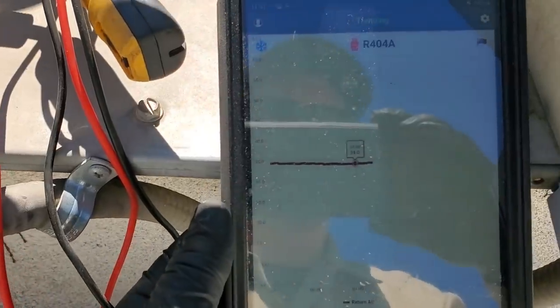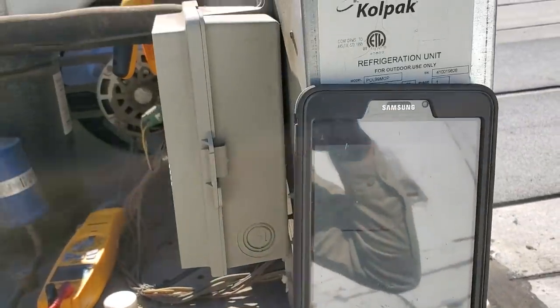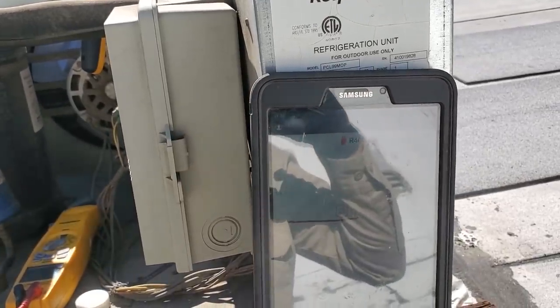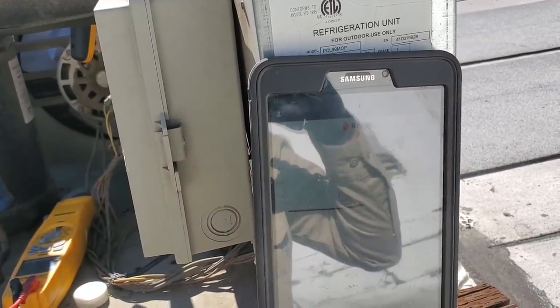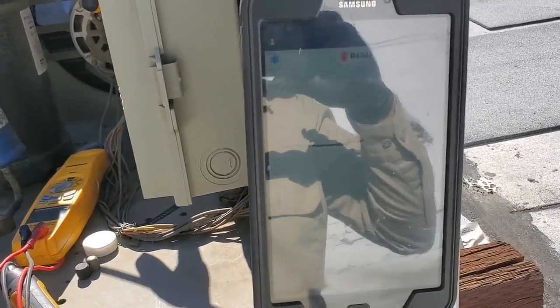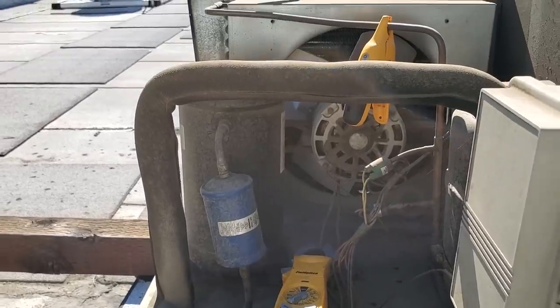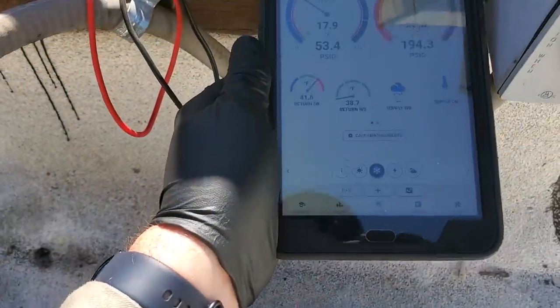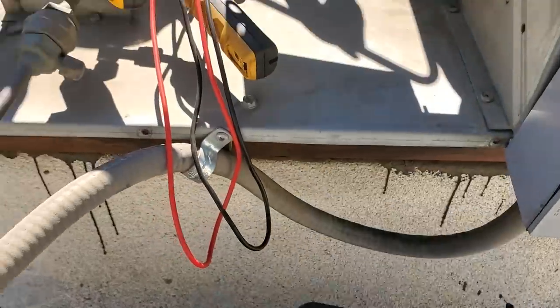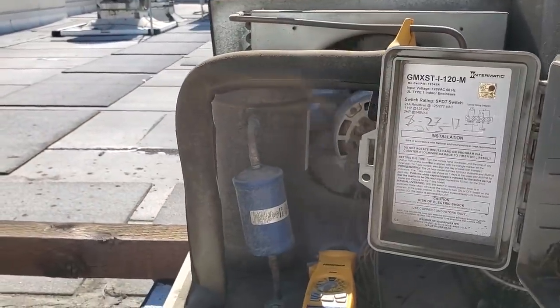I'm trending right now and I want to see what it turns back on at. The first time it turned back on at 39, the second time at around 42 or 43. And now we're cutting in at 42 again. Customer's complaint was last night it got up to 50 degrees in the box. This is looking like there's a temp control issue.